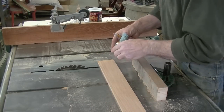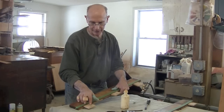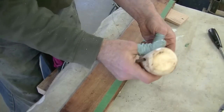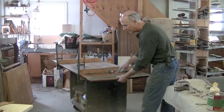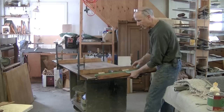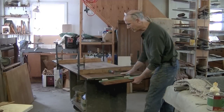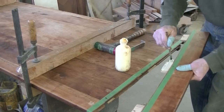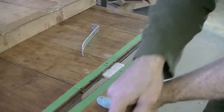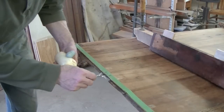Now I'll cut my tenons into three-inch lengths. I've carefully fit all my tenons into the mortises of my end. I've numbered these because I've also checked them into my mortises and the rest of the top. Now all the tenons get glued into the end boards. I'm ready now to attach these breadboard ends to the top. I'm only going to glue the center tenon to the tabletop. The other tenons will be floating so the tabletop can expand and contract. Because the top isn't flat, I've put these cauls on here to hold it flat while I assemble it. I'm going to glue the center and drive the main piece and load it to the top.